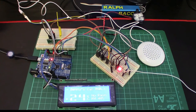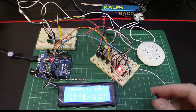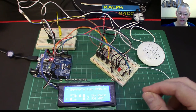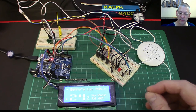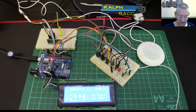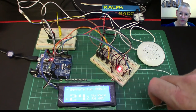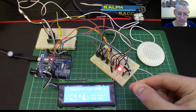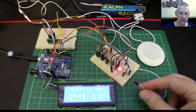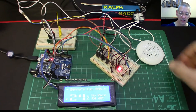The only thing I've changed since yesterday when I recorded it was this on/off switch — a touch switch, as seen in the fridge alarm project. If I hold it, it beeps and goes off. The reason it didn't come back on again is because in the code, once you've touched this wire, it won't take any more input until you let go and the reading drops below 100. It just suspends until that drops.